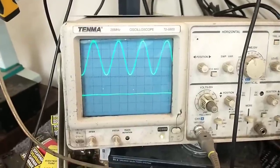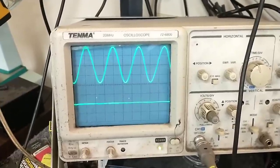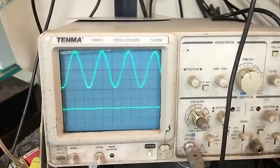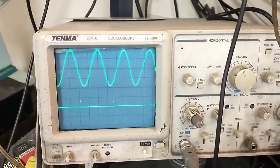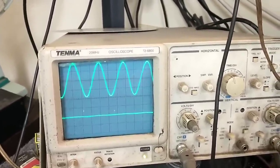We can usually ignore the input selection if one channel is out regardless of mode — like if you switch it into mono and the right channel is still gone, it's not in the input selection. It's either going to be in the preamp or it's going to be in the power amp. We have a scope here that we're going to use to find out where the problem is, and I'll show you some quick narrowing-down tips on how to do that.